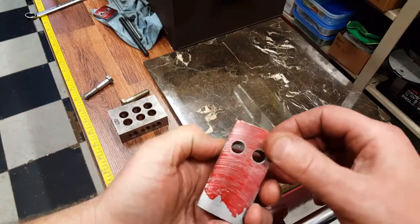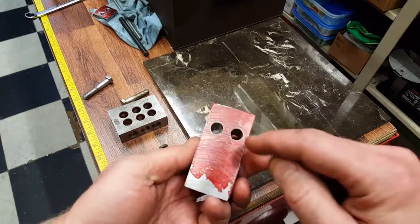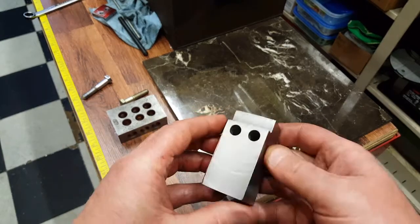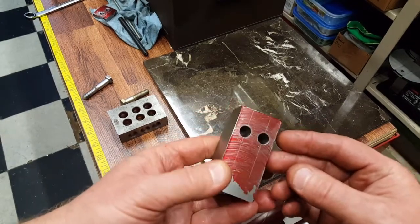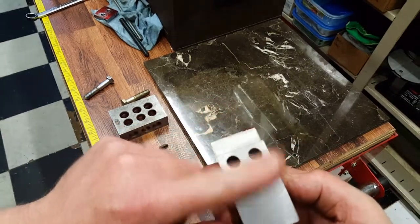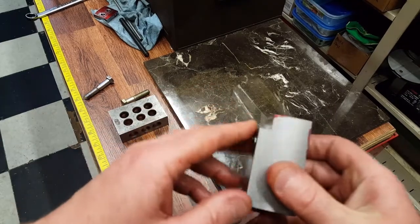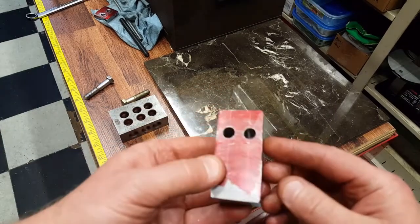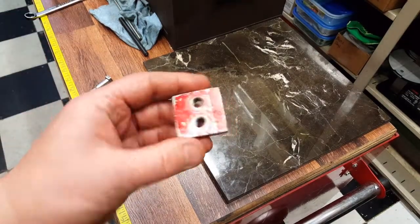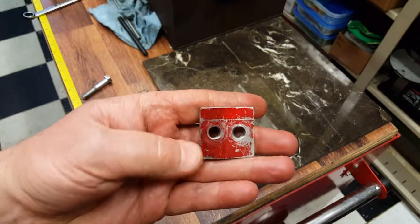And this is the finished product of what we just got through doing, drilling holes where they need to go. Got all our measurements like we needed. So the next thing to do is to mill the bottom piece, which is our clamp for this particular carriage stop. Well, I've already done that. I've already milled it out and even drilled the holes, so we're a step ahead.